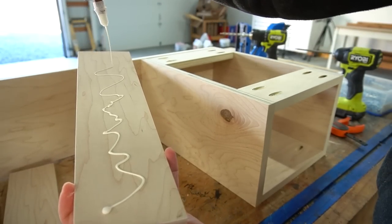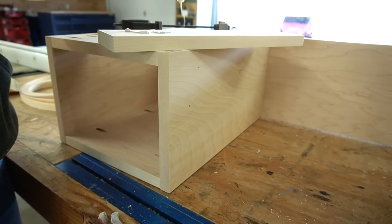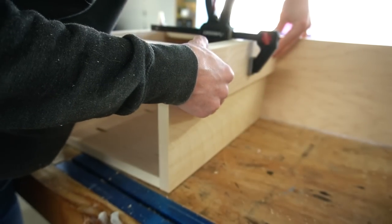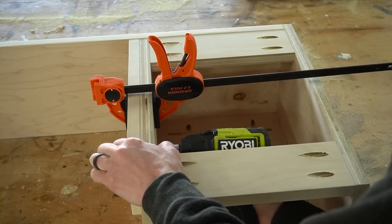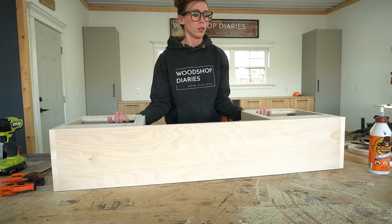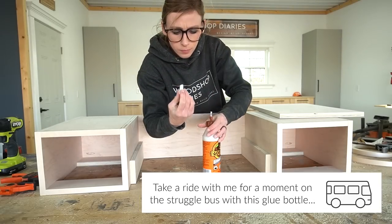For the center section, I cut some plywood pieces to glue and screw into each side. I made the center section about 13 inches deep so it insets the outside sections — this is totally optional and just for looks; I thought it added some extra dimension. I edge-banded all exposed edges before installing, then flipped everything upside down and glued the center bottom panel in place.